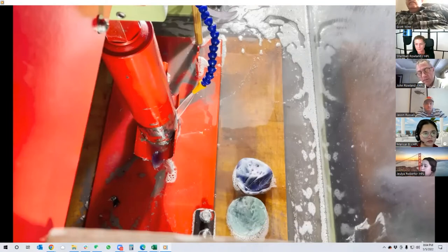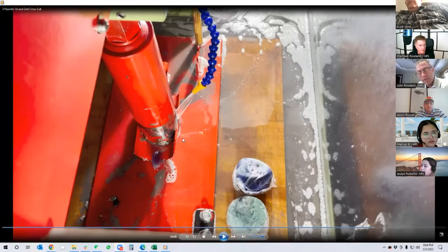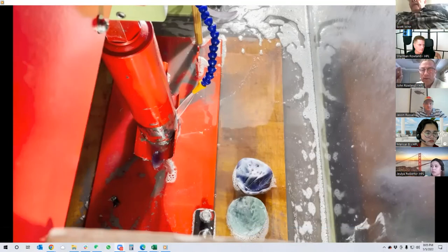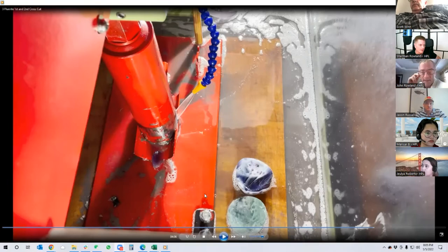See these tabs here? The mounting tabs on the jig, Sherman. Go down. Mounting tab. Here. Yes, those are adjustable. So when you first put your jig in, you adjust it front to back so the bit is matched up the same on the front and the back of this cradle. Then you set your feed really slow, and you drill through the rock and the jig on your first time. Now, Diamond doesn't like to drill steel, but ours will drill it just fine. Once you have that first drill in there and your jig is all set, the beauty is that when you drop that jig in each time, it's perfectly aligned and repeatable. These align the positioning so you're directly under your core bit every single time.